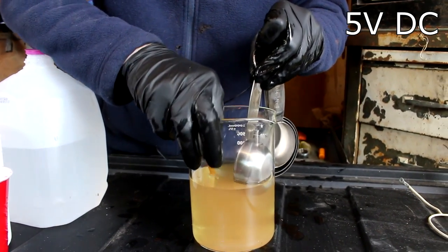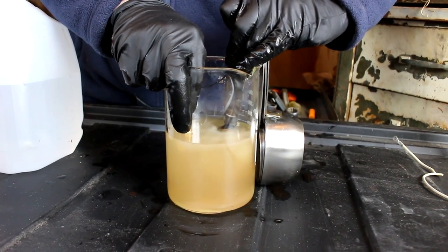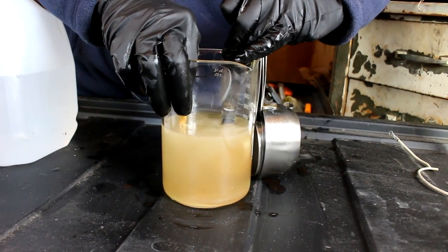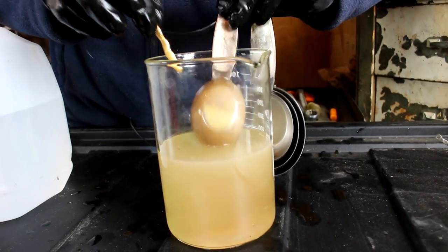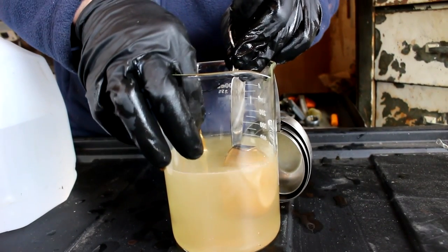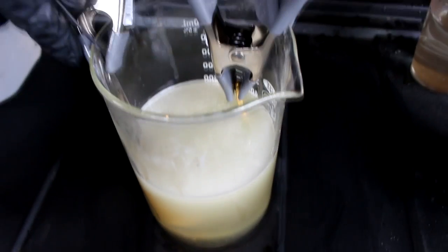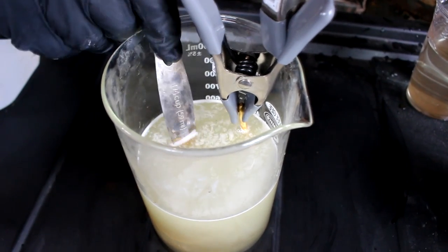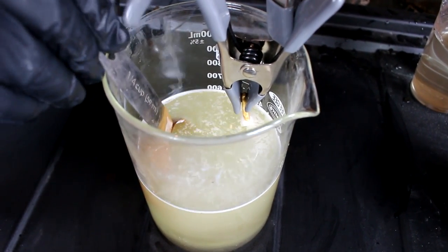Negative to the thing I want plated, positive to the gold. What's happening here is the electrons are going into the negative electrode and they're reducing the gold at the surface of the metal. At the positive electrode, electrons are being taken away — this oxidizes the gold so it dissolves into the solution. As you can see, we're getting a layer of gold on the surface of the part. I might have to find some alligator clips so I don't have to sit here and hold it, because it's going to take a little while. I can just let it sit here for long periods of time and move it around to get the other side. It should look cool when they're done.